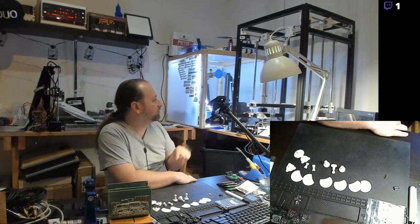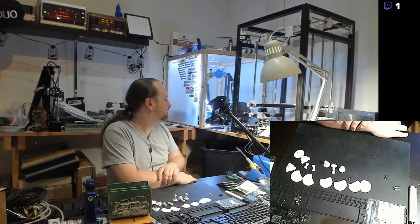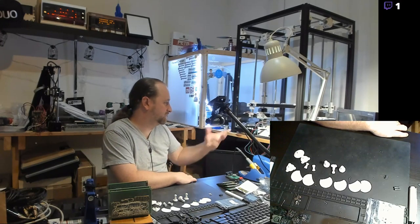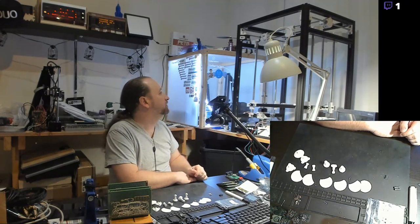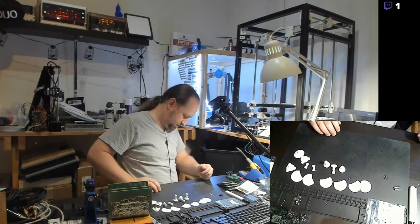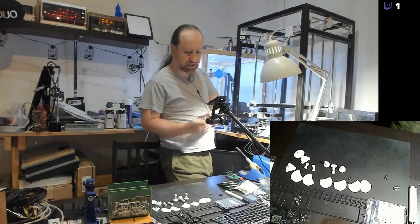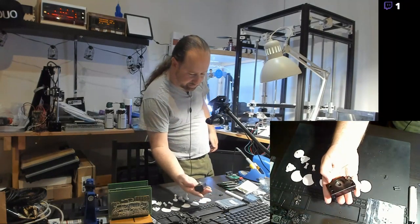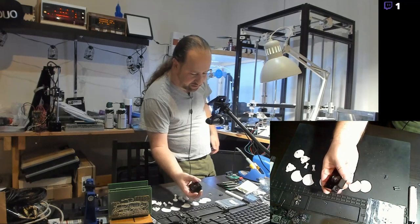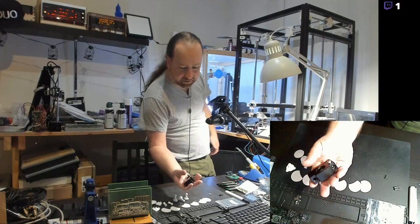And I did buy those ball screws probably 3 or 4 months ago. They weren't super expensive. Honestly, the biggest problem I have with the ball screws is that I had to design and print out mounts for them, the retaining mounts on the bottom, because the mounts are just, let's see if I can pull these out. Like, the upper mounts are freaking solid blocks with, of course, the bearing pressed in. These things weigh a ton, and these are the upper ones that are thinner. The lower ones are almost twice this weight, larger.